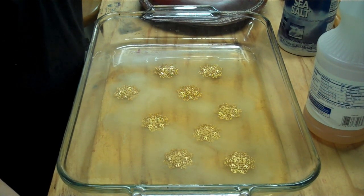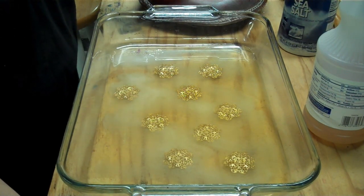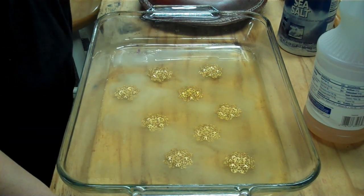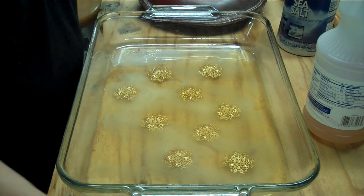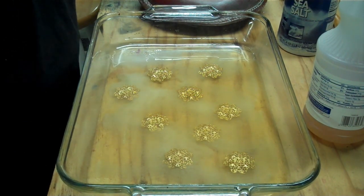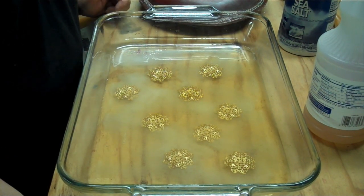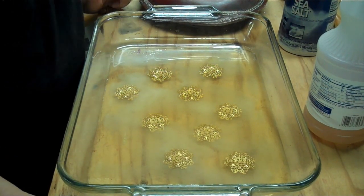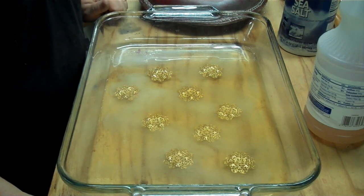This is a good way to clean brass too, as a matter of fact, because it'll kind of bring up the copper that's in the brass, make it look a little rosy, but it's really perfect for getting your stuff started to get the patina going and the chemical interaction going. But that's it. Nothing toxic there. It's a little strong smelling because of the vinegar, but that's all there is to it. You leave it sit 20 to 30 minutes, couple hours, overnight. You play with it, whatever you think, but you got to get at least 20-30 minutes of clean brass in this bath.